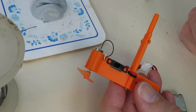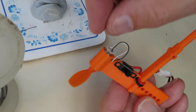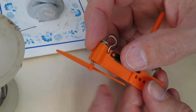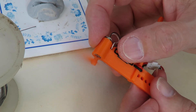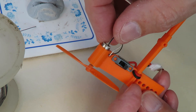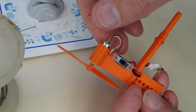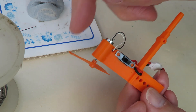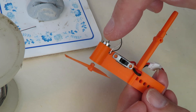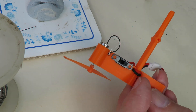Well, it's not all good news. I've just realised I obviously had that rotated slightly, because this is running in reverse to the way that it was. So I've obviously rotated the cap on the back there by at least 90 degrees, if not 180 degrees. So the commutator is making contact with the brushes at the wrong rotational angle.